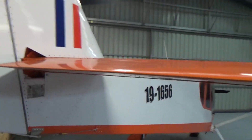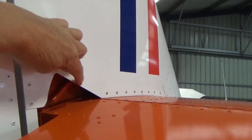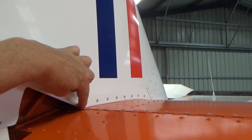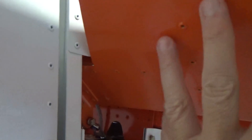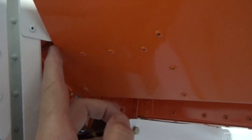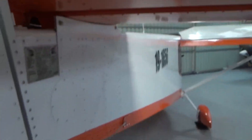Elevator — very sensitive, very sensitive on the elevator. You do have to clean up this particular angle here, depending on where your tail plane sits, to the hinge line. I did have one little tiny contact point just right there when the wind would blow it or something like that. So a little round file — just cleaned that up and took a bit of radius off this back edge here. It's the only rubbing I've found at this stage.